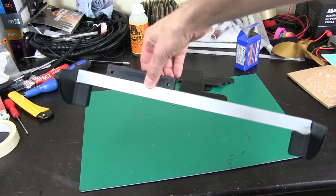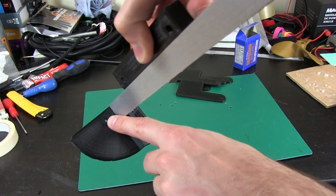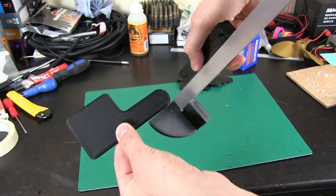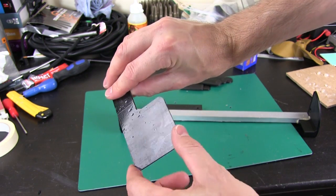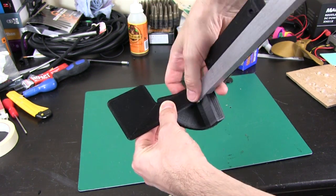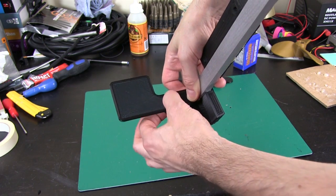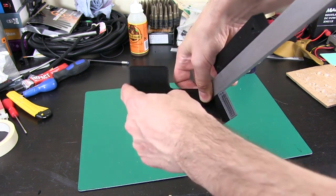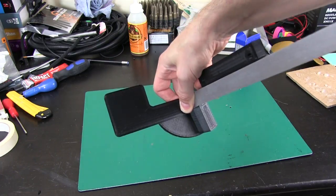Here's one of the sticks I made last time which bolts onto the whole shoulder universal joint assembly. On each end I put these curved pieces that have a hole in them, and I made this curve so I can set things at a different angle. The aim is that we will be gluing these onto the shoulder bell. I'm going to heat these with a hot air gun and bend them to match the contour so we've got a large area to glue onto the inside of the shoulder bell, and then this will get hinged on that hole with a screw in there. The angle is actually going to be right off the top of the curve — I probably should have put the curve up the other way, but nonetheless that'll work pretty well.